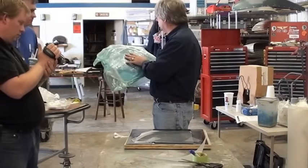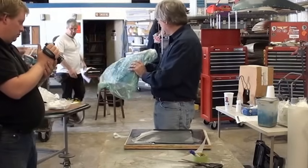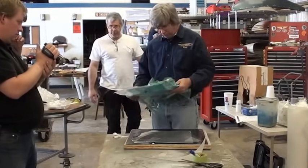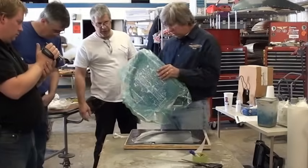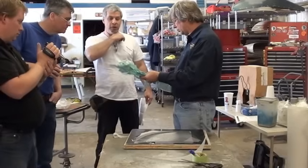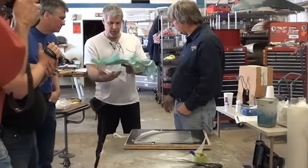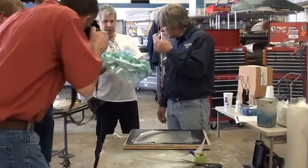So anybody that wanted to see the status of our mold here, we got it pulled out of the part over here. And you can see we pulled it off with the bleeder ply in there. Now that's all just absorbed in epoxy, but that's quite a bit of weight to be actually pulled out of that part. Yeah, once it's all stripped down.